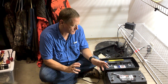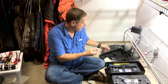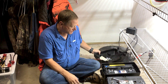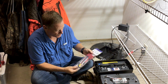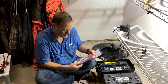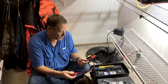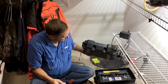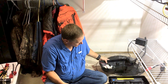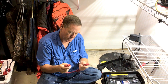Today we're going to take some Connect Ease products and actually install on a backup sump. We have a single and a dual capability. This would be for a single battery if you just wanted to put one on there. I live in a wet area, so we're going to use a dual battery setup for our backup sump, as sometimes our power can go out for one to two days and actually causes basement flooding.